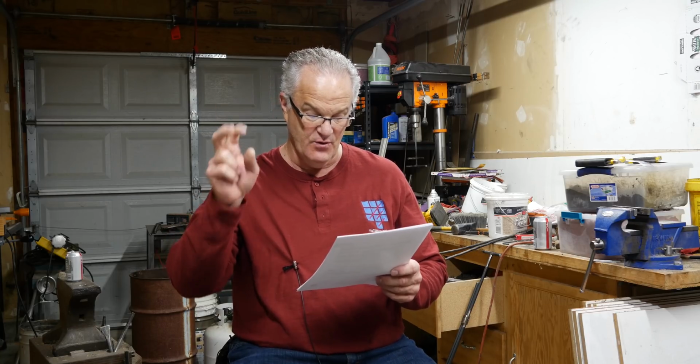All right, rule number 3. Avoid laminar entrainment of the surface film on liquid. This is the requirement that no part of the liquid metal front should come to a stop before complete filling of the mold cavity. The advancing metal meniscus must be kept alive, and he's got alive in quotes, i.e. moving, and therefore free from thickened surface film that may be incorporated into the casting. This is achieved by the liquid front being designed to expand continuously. In practice, this means progress only uphill and a continuous, uninterrupted upward advance, i.e. in the case of gravity-poured castings from the base of the sprue onwards.